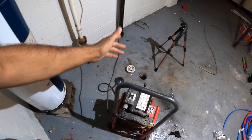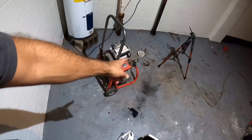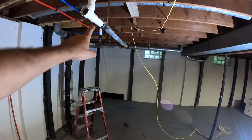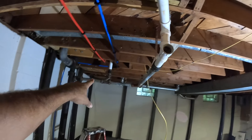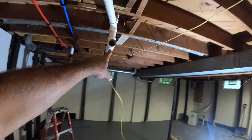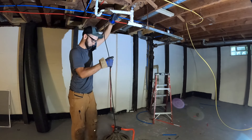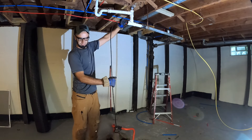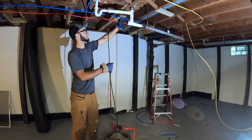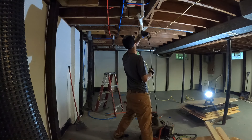One of my favorite machines — it's quiet, easy to use, no complaints, and I haven't really had any issues. The only thing I did was change out that cable. Because I'm down here, I'm going to go ahead and snake this bathtub right here, and then over there is the bathroom sink. I'm going to snake this as a preventative. What I normally do is lay the cable down on the back, and if needed on a really bad drain, I'll run the cable inside a piece of inch-and-a-half or inch-and-a-quarter PVC just to prevent it from whipping around.